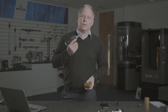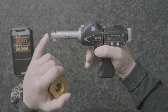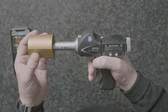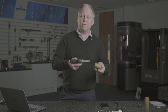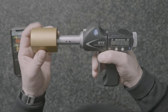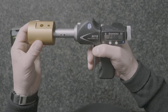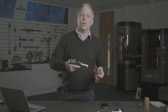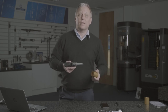Now let's run that same scenario through with the Bowers solution. We've got a measuring range on this head, so I can measure any diameter of thread of this pitch within the head's range. The pistol grip lets me retract the anvils and insert quickly. I can deliberately set my thread milling to a small size — safe — then put a number on it: read the effective diameter on the first go, calculate exactly the offset needed to hit the bottom limit of the thread tolerance, and get there first time. It's quicker, no screwing gauges in and out, no guessing at offsets, and no risk of scrapping parts.